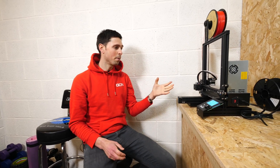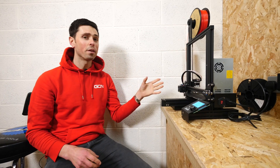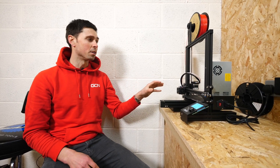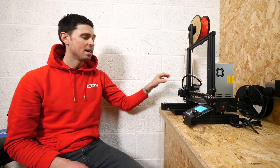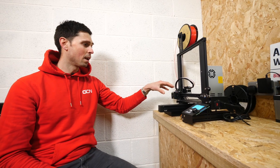This is my 3D printer, but don't get your hopes up because it's a hobby-grade 3D printer. This is not the sort of thing that can be used to 3D print a bike or structural components because this uses a plastic filament cable which is wound through here and then heated up into a liquid plastic, then deposited in separate layers to build up the item you're trying to manufacture. So it's not intended for large components or anything that needs to be very strong.